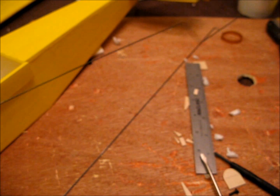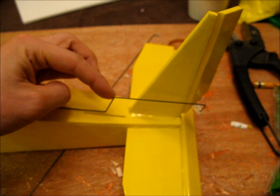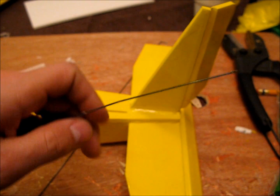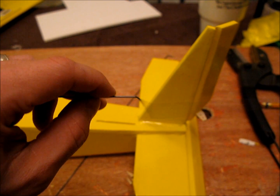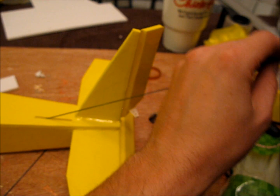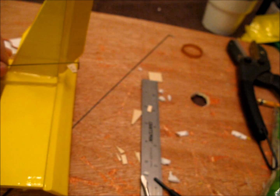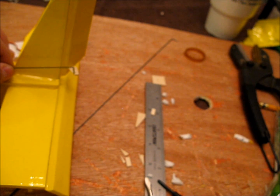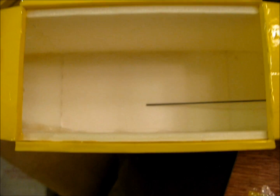As far as the linkage for the tail and rudder, the first one here is for the rudder. Basically what I did is a little 90-degree bend to go into the rudder, then measured until it was about centered with that channel, bent down and then over again. I did the same type of thing where I didn't quite do a full 90 here, and that helps when it's pushing to do a little better on the tension. You end up sticking that in here, dropping it in there, putting the aquarium tubing on the little bottom edge, and cutting it so it travels about to center.